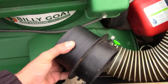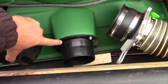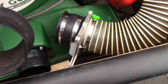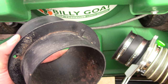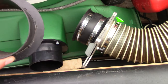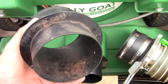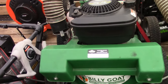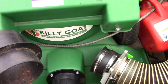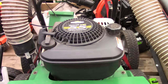Originally, this piece was on the end of the hose that would be slid into this area where the flange is. So picture the flange missing — there's a plate that's normally covering the hole. You remove the plate, this part would be permanently installed on the hose itself, and then it gets slid in and twisted because you've got these screws that allow it to be slid in and then you twist it to hold it in place. I'm also thinking about using this to rig up an extension where I can clean gutters using the Billy Goat — get up on a ladder, put the hose in the gutter, suck everything out. Makes the job nice and easy. We'll see if that's a pipe dream or not.